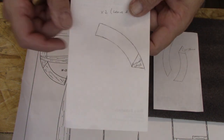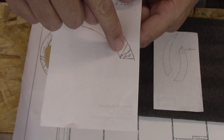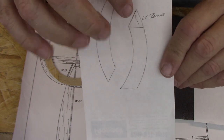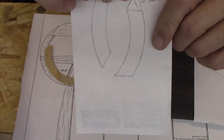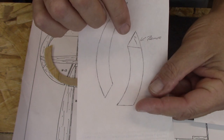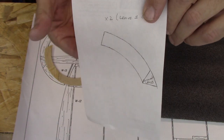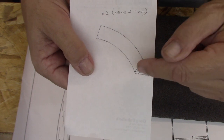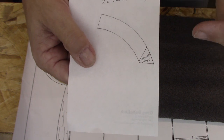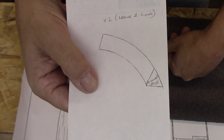This is what I'll do on the top piece. The top piece — this angle will still be here on the bottom piece. Both bottom pieces will be cut exactly the way they were originally. But what I'm going to do is on the top piece, I'm going to cut this off on the bottom and leave this one attached on the top. That way we have a triangular shape just to strengthen the whole tip. That's the proper way to do it. So I'm going to go ahead and get these things cut out on the bandsaw and then come back and get things glued up.